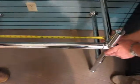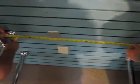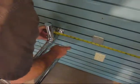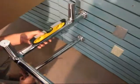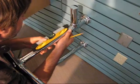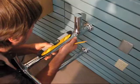To set the next two wall flanges, we're going to measure the inside to inside width at both the front and the rear of the washstand, making sure both measurements are identical. And once we've adjusted this horizontal, we will mark the wall, the location of that wall flange. Now we're leveling the left side top horizontal, and again marking out the wall flange for the proper location.